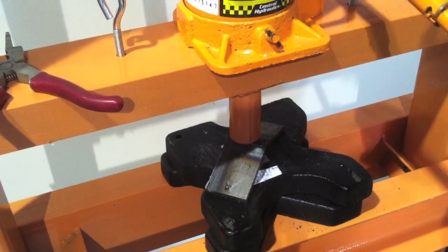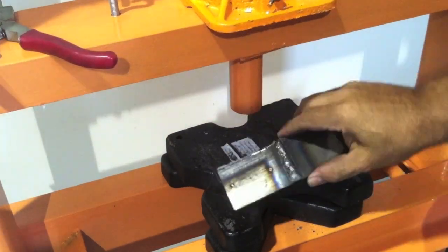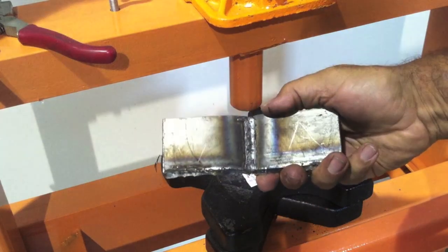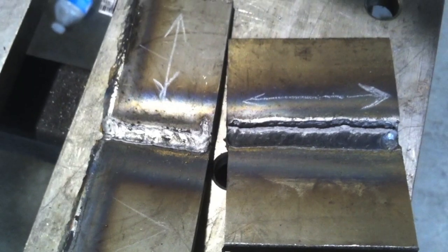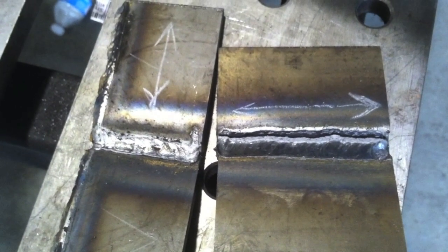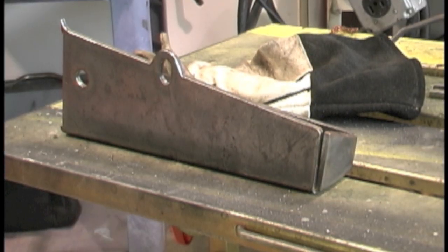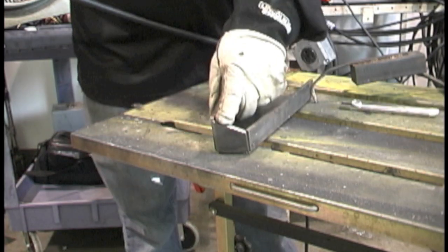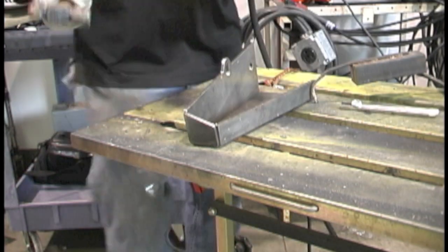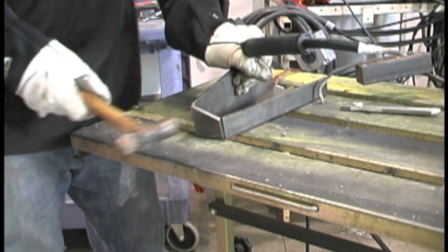I can tell immediately it's much better. The pieces are longer and narrower, but I pumped it all the way down and the weld did begin to separate at the toe. It took a lot though — I'm bending quarter-inch metal against the weld and expecting something bad to happen. It's not a code test; it just gives me an idea of where I'm at when welding outside corner joints.